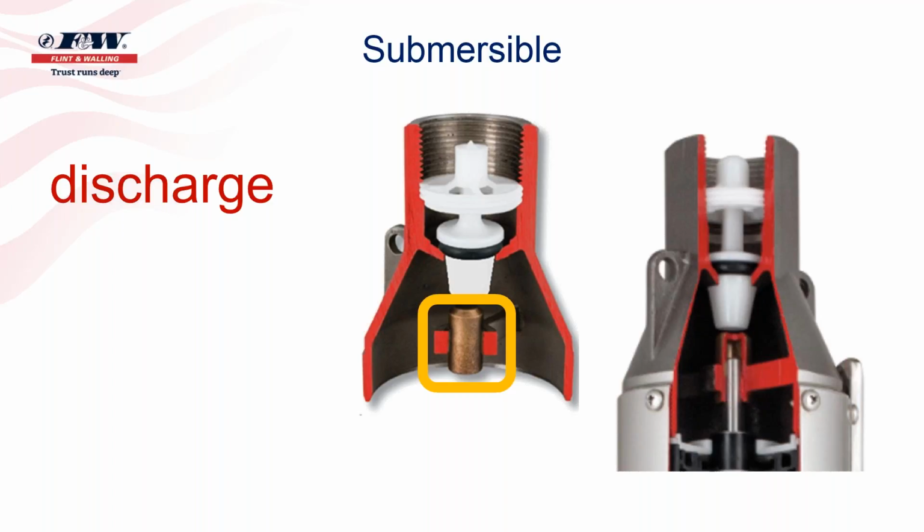It's closed. So the image that's on the right of your screen, you can see the pump shaft going into the bearing, but if you move on up above, you can see that that bearing's closed on top. A lot of companies will choose to use a sleeve bearing of some type where the pump shaft actually goes all the way through the sleeve bearing. You see it go in the bottom and come out the top. We've chose not to use that design because, first of all, it's not watertight. Water can get between it.